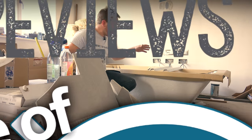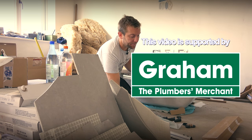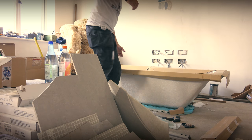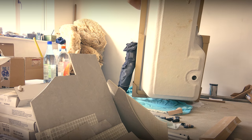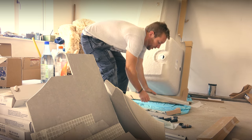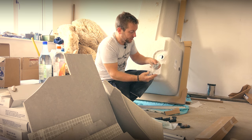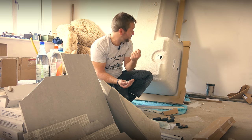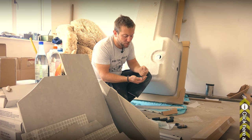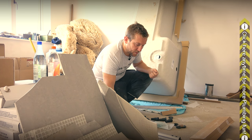Here's the bath we're working on. I've already taken out the pack that's got the feet in it. Usually you'll find your bath has got two big beams like this. The first thing we want to do is get our bath up on end and fix the feet to it. What you're looking for are these tiny little screws. We don't want too long of screws because there's a plywood base in here that's only going to be about 8mm or 10mm thick, so we want to use the little baby screws so that we don't go through that base.